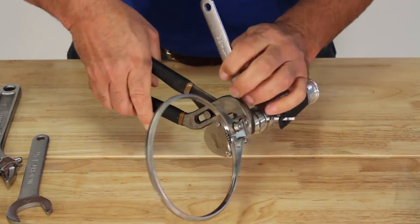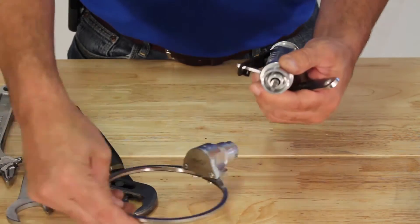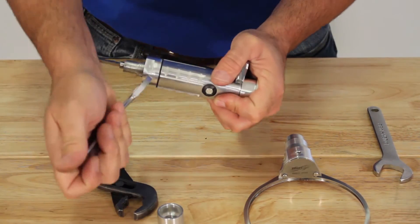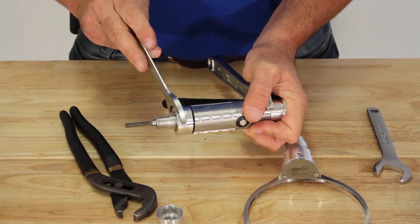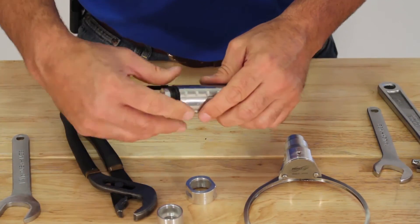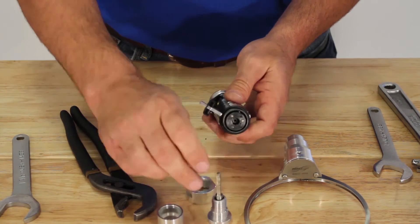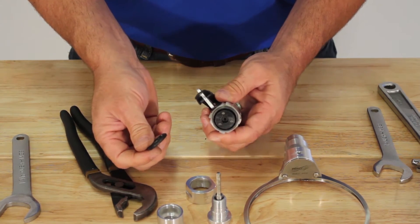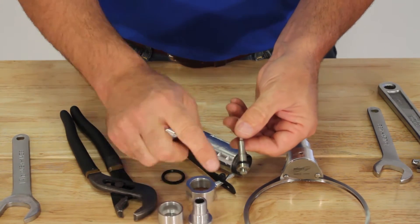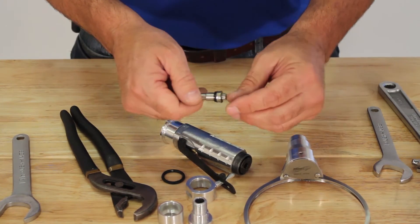For the air tool breakdown, you'll release the housing, remove the jam nut, then remove the motor nut. The drive shaft housing pulls out of the planetary gear, along with an O-ring seal. The housing drive shaft pulls apart, exposing the drive shaft and the U-cup, which will need to be changed if air or oil is blowing by the jam nut or the head area.